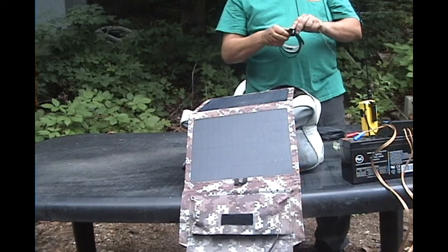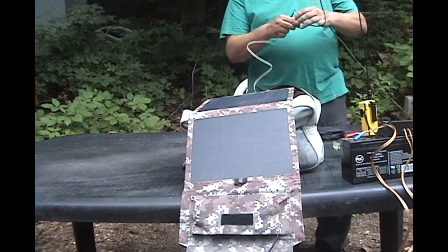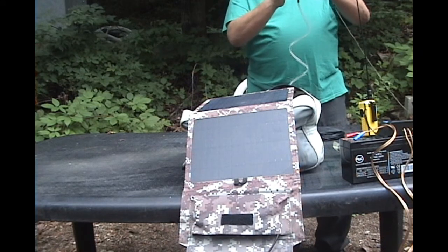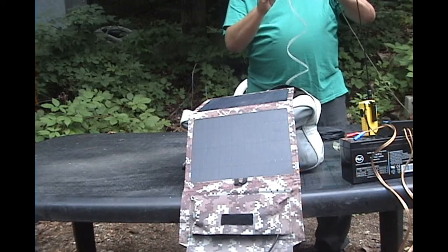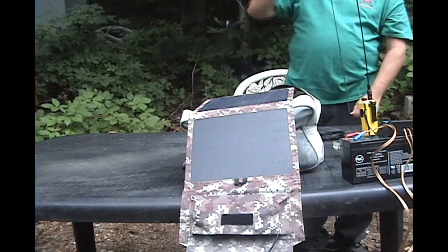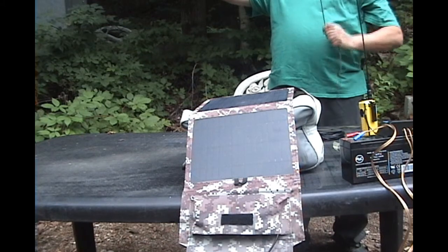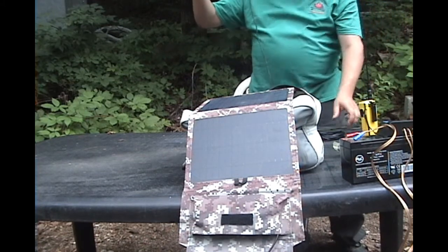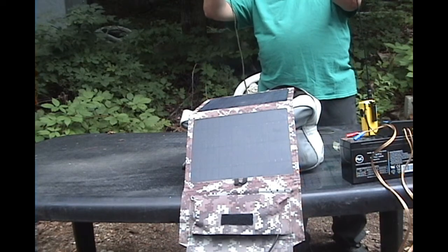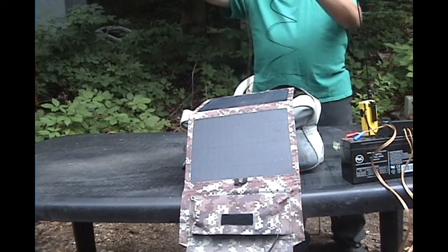And we'll attach our Slim Jim here. No adapters are going to be needed for this because when I ordered the Slim Jim, I told them it was for a Baofeng radio, and it came with the proper connector set up. A lot of people sell you an antenna with an SO239, PL259, whatever they are, and people will tell you, well, that's just the most common connectors. This guy actually asks you, what radio are you using? I will set it up for that radio. Nelson Antennas on eBay. He's awesome.